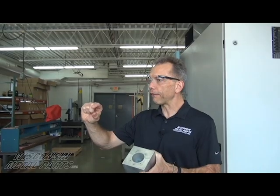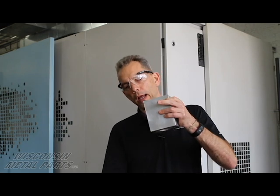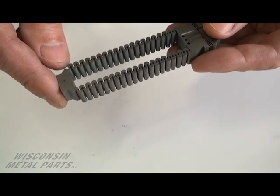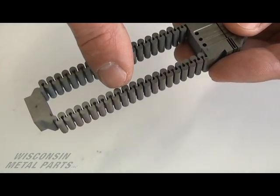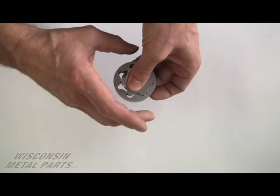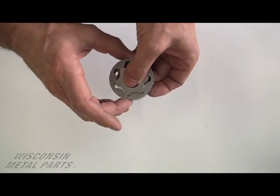A part that is a half inch thick is going to react much differently and require different machining than something that is 16 inches thick. We can also do really close tolerance, very fine detail work in a part much like this. Here we have a part that goes into a pump — it's a rotary with two separate parts here but very close tolerances in order for this to work. Something like this we would have wire cut out of a separate piece and probably did three skim passes on it after the rough cut.